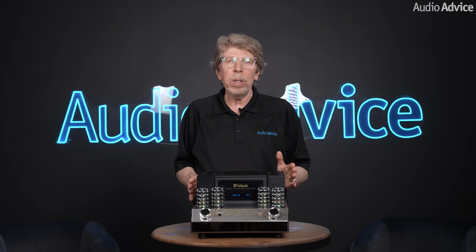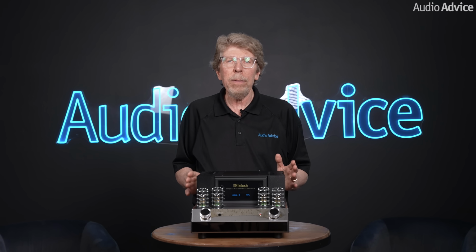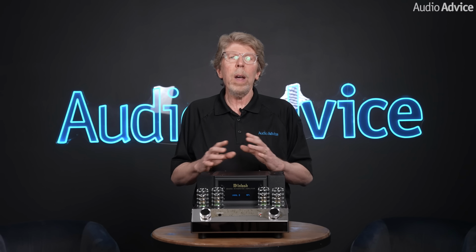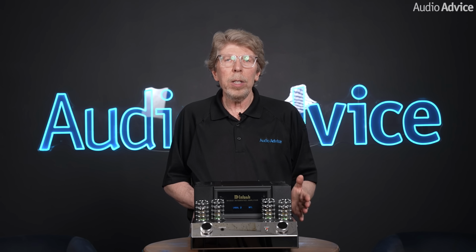They also incorporate some pretty neat output transistors. Most solid-state power amplifiers sound better after they've been warmed up for about an hour, but McIntosh uses their advanced high current output transistors that sound great from the first minute you turn them on. They have another advantage in the way they control the bias that reduces distortion on passages where you have lots of dynamic changes. Another neat tech used in almost all McIntosh solid-state power amps is their patented PowerGuard system.